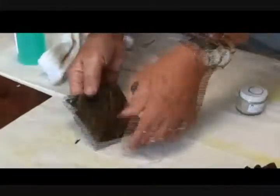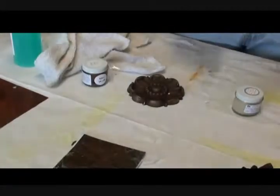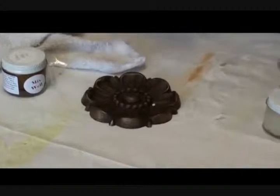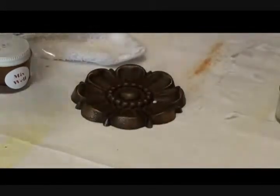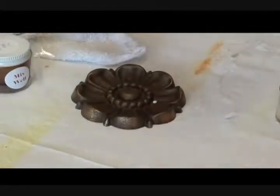And so now you're using another wax, or is that an oil? This is an oil. The thing you have to consider on these, the Smart Coat is probably good for 5 years, maybe. The oil and the wax are maybe good from a year to 2 years. So there's a shorter lifespan on these two, which means you'd have to do them again. Indoors, indefinitely. Outdoors is what we're talking about for the 1 to 2 years.